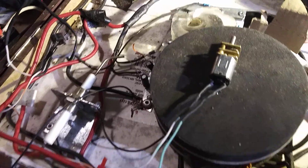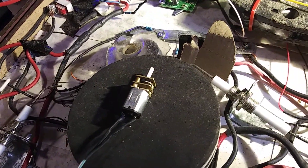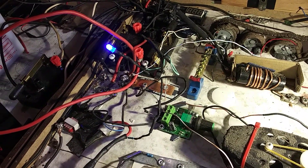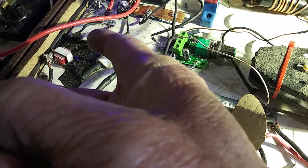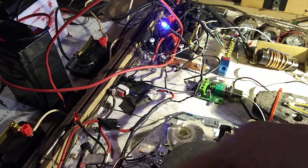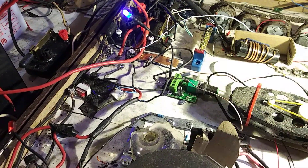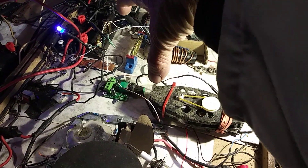This pops sparks and introduces electricity into the system. When I turn on this 6-volt switch, I've got a little gear reduction motor attached to it and an LED light to indicate electricity running through there. This half of the circuit feeds electricity to this transformer, which goes to a bridge rectifier. The bridge rectifier cycles electricity one direction on one half and the other direction on the other half.